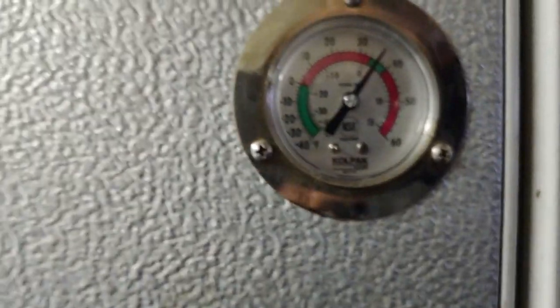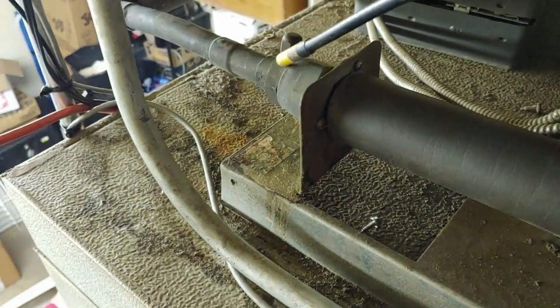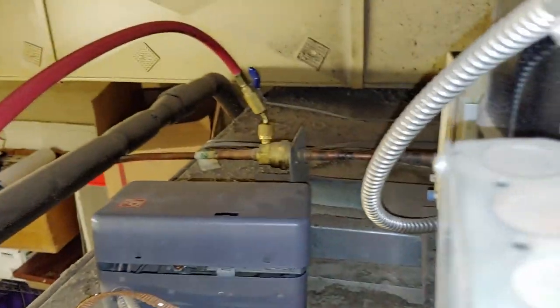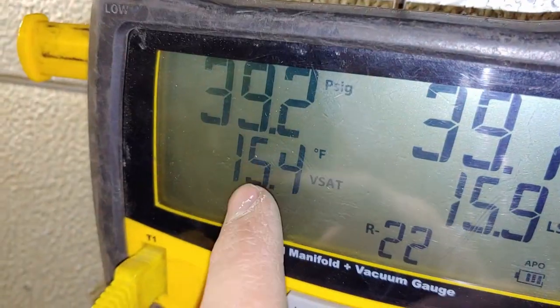Anyway, we're going to go back in and make sure the system is cooling down — and I think we got this one figured out. It's getting cold in here, nice — that's where we want to be. I did do a general leak inspection on the unit, not super extensive, just to make sure there are no big leaks. Now we're going to take the high side hose off — I always use a strap because it's way easier. We still have high pressure in here, so we open this to let all that liquid back into the low side — perfect for a cooler.